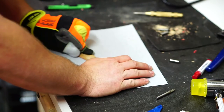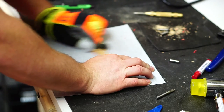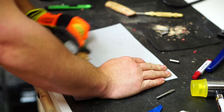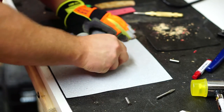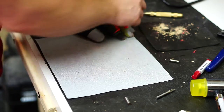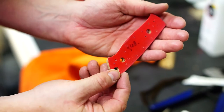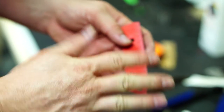I'm using some sandpaper to roughen up the back of the scale to give the epoxy a little more surface area to grip onto. I also drilled a few little divots in there — the scales are sanded but still kind of slick, so the extra recesses give the epoxy a place to settle into.